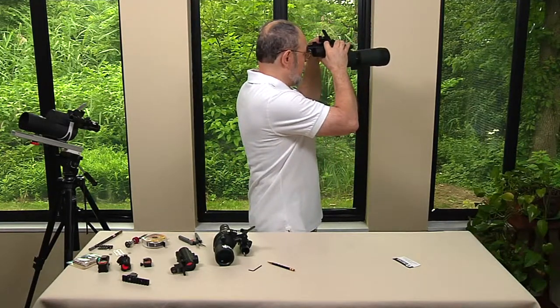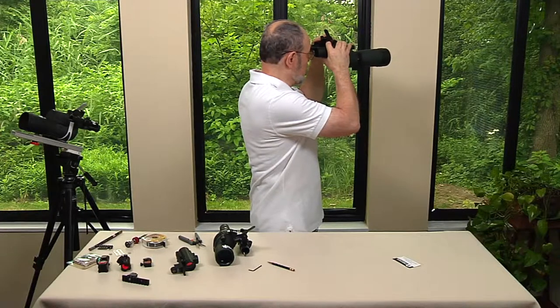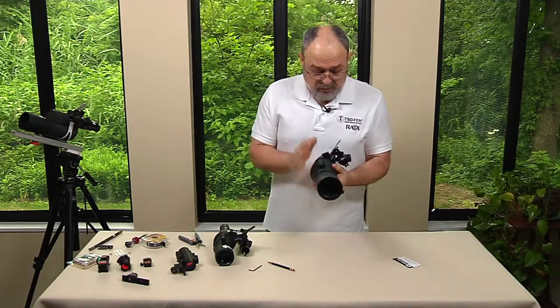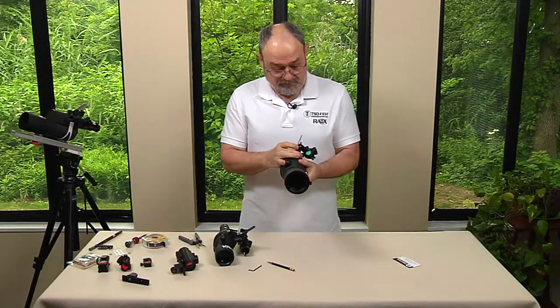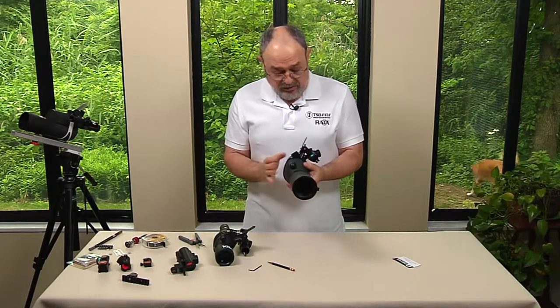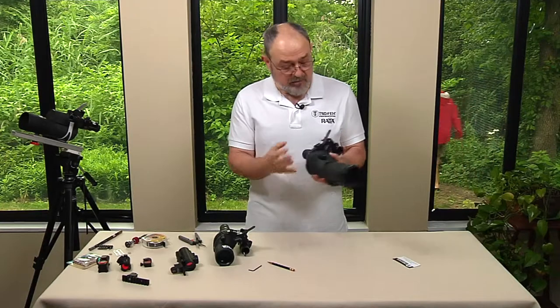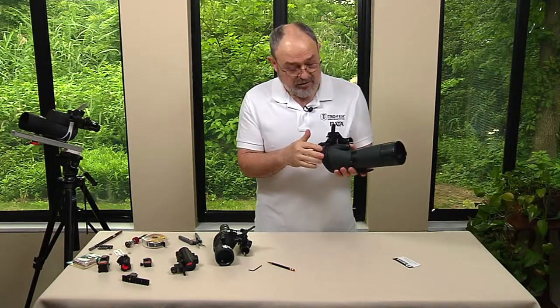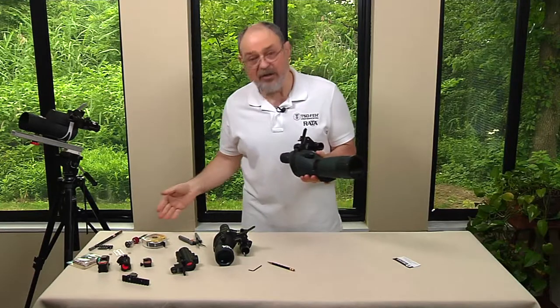Now we look through it and it's nice and parallel — almost perfectly. So remember, it really is worth taking the time. Take all the time you need. Get it parallel. Sometimes you might see that you need to put tape on three of the feet. Go ahead and play with it — plenty of electric tape. You will not need to put a lot of layers, but however many you need, put them on until you get it right.